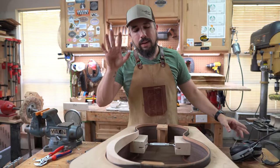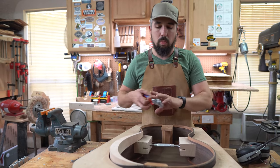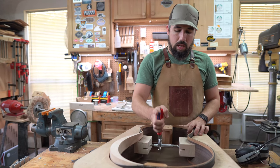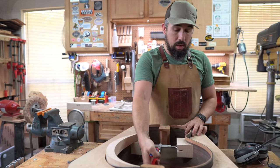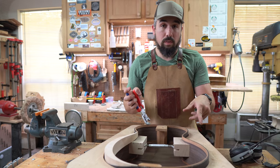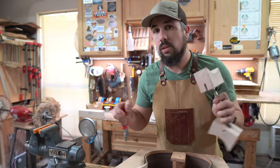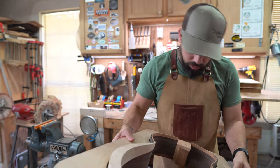I think I got it mostly there, but before I get it absolutely perfect I'm going to pull this spreader out because I'm noticing more glue squeeze-out than I thought. Before you radius this completely perfectly, you do want to make sure you're getting all the squeeze-out done first, because I have to pull the mold spreader out in order to scrape off the glue. You don't want to radius it until it's in its place and you're not going to move it anymore.